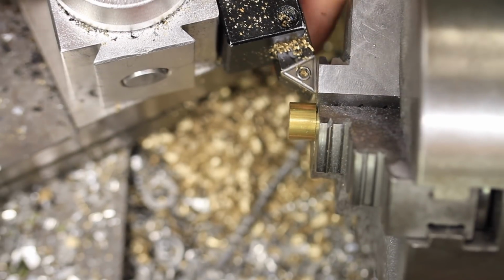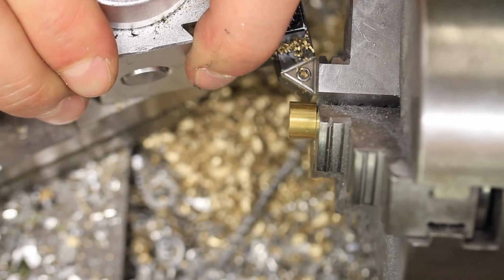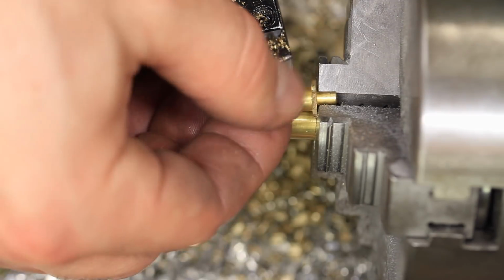After a quick facing, I squared the tool against the chuck this time, but I don't know if it makes much of a difference either way. Finally, I brought the other side to its final dimensions in the same way I did the first side.